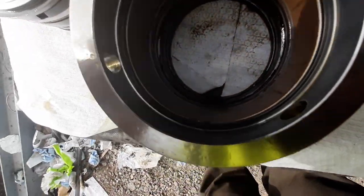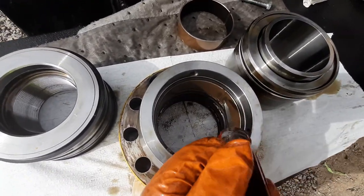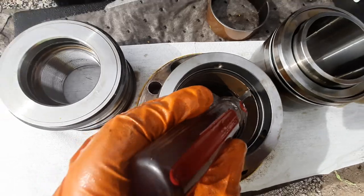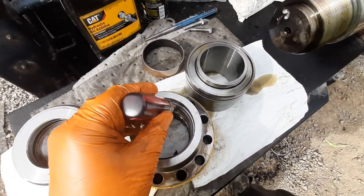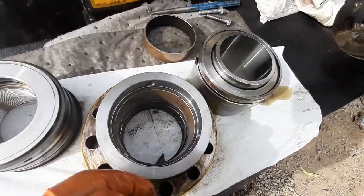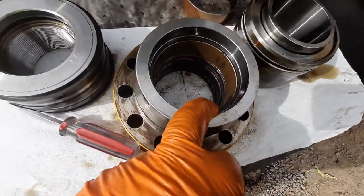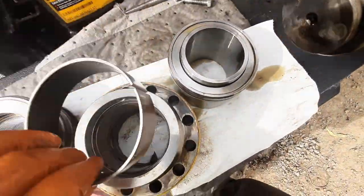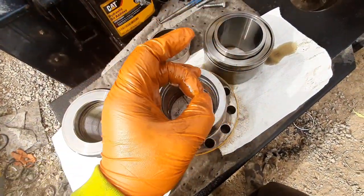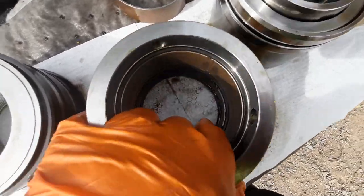The seam is the biggest pain of the whole job when resealing. Put the screwdriver or chisel on the corner of that edge — it's better to use something soft — and tap it with a small hammer. Drive it down and it will peel the side wall out, allowing you to grab it and remove it. Then take the new bushing, drive it in using an aluminum square block, tap it around the edges, work it all the way back in, and put your snap ring back in the groove.